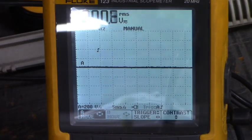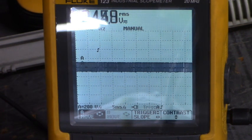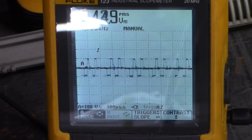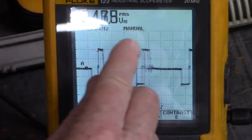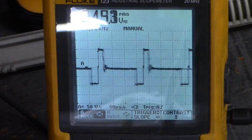Now let's take a look at the waveforms out to the DC motor with the oscilloscope. I've got the fans disconnected because they're pretty noisy. Let's spread that time out a little bit to increase our waveform. There you go. Now you can see the transistor is firing, and right here is the average DC applied to that motor from the drive.